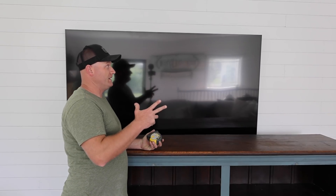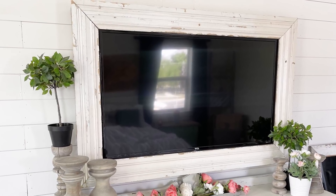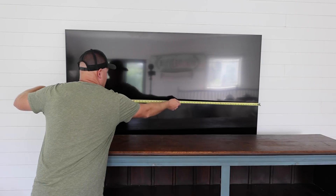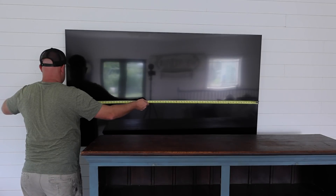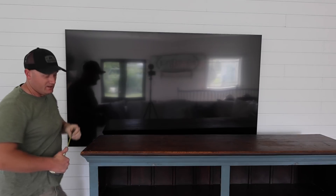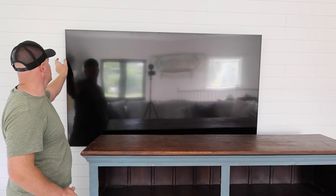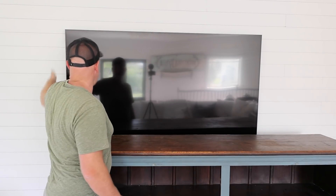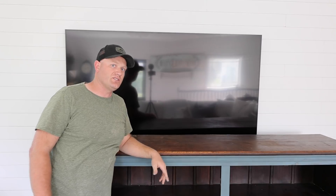When you're going to frame out your TV — we have it in another video, but I'm going to show you again. Carefully, so as not to scratch your screen, measure exactly the exterior dimensions. This one is exactly 72 inches wide by 41 tall. I need to fit my frame around that with about three inches on each side so I can have a box around the outside with air to move so you don't overheat your TV.